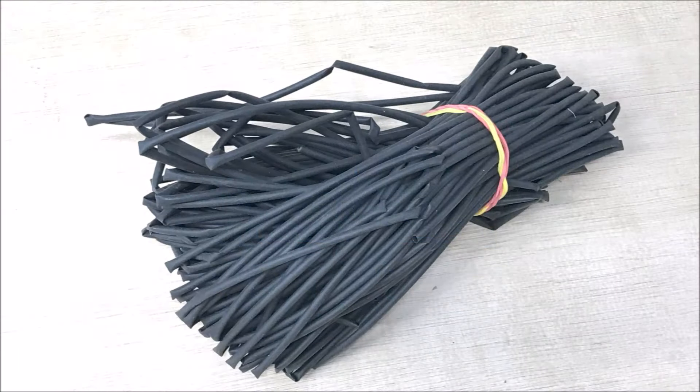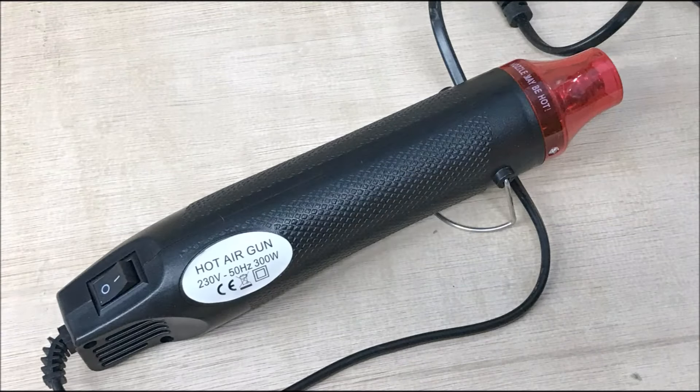One last thing that might sound a little advanced but is a good idea is shrink wrap. It comes in all sorts of sizes — this I think is 3mm shrink wrap, which is ideal for the sort of wire we're using. You cut it into a small half-inch length, slide it over your soldered joint, and then by warming it up — either with your soldering iron or with a heat gun — it shrinks onto the wire and protects it from short circuits or mechanical damage. A little advanced, but if somebody gives you some that's ideal. I wouldn't go out and buy any just yet, but it's something to think about for more complicated joints.